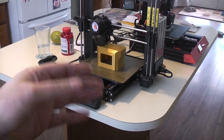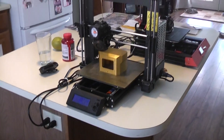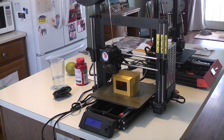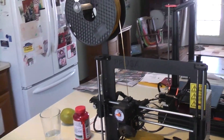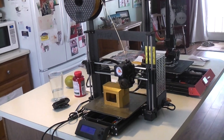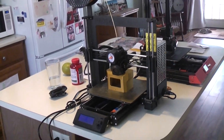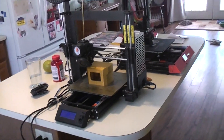Today I was running some parts for two different robot projects and I just had to crack open a brand new spool of the gold and a brand new spool of the silver, and suddenly no stringing. So what's been going on for all this time, all this long winter, is all my filament — even though I keep everything bagged or in a container except for when it's on the machine — has gotten moisture in it. So it really does come down to my filaments needing to be dried. I'm going to have to set up some dehumidifiers and suck the moisture out of my plastic if I want to get rid of the stringing.